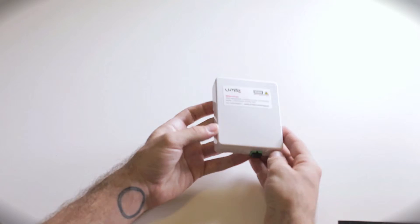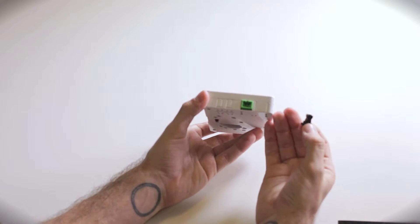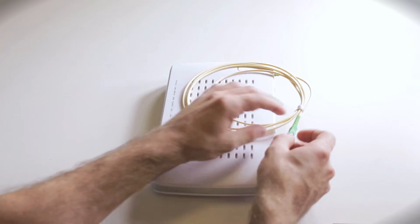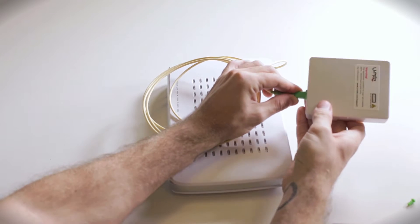Take a look at your fiber box — it will have a black or white cap at the bottom. If it's black, you pull it out; if it's white, you just lift the cap open. The drop cable will plug into that. Just lift the cap off the end, groove towards you, pop it in, and it's connected.